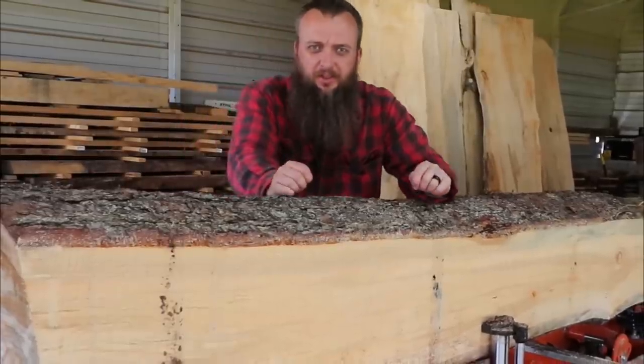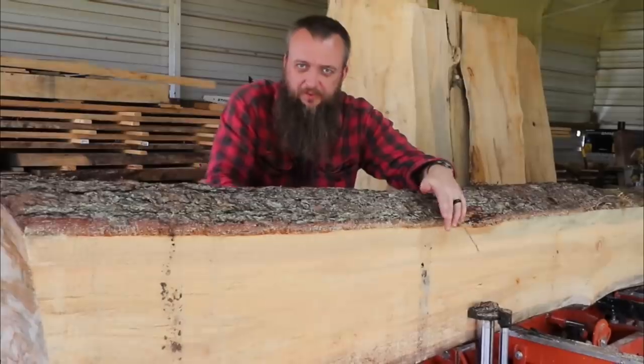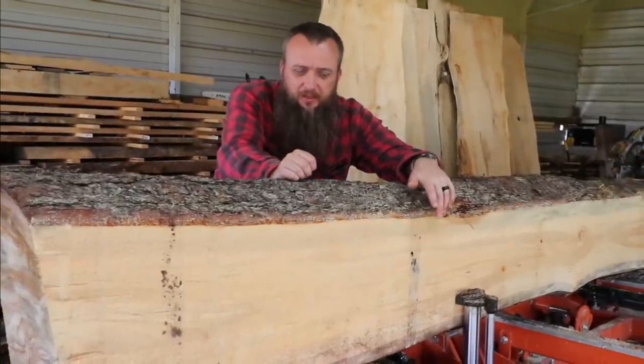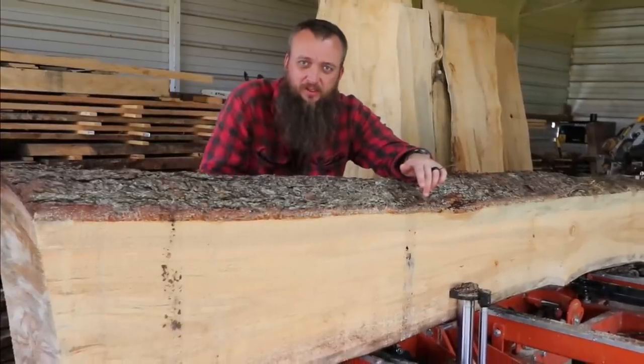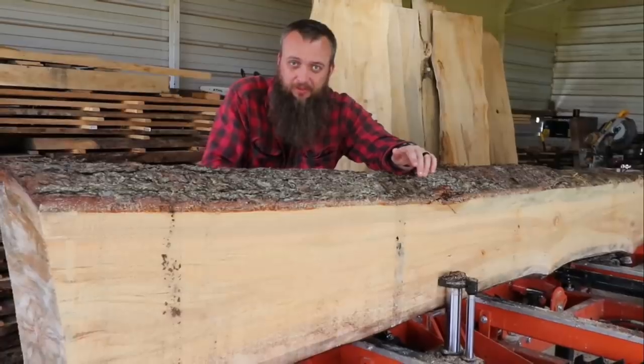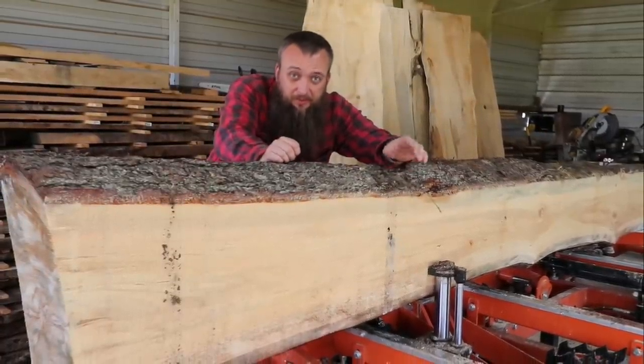Right now, friends, usually when I square up a timber, this is my third cut. I make two reference faces, one cut, turn it 180, make another cut, then I put it up on its side like this to make the very important third cut, which is going to either put the timber perfectly in square or it's not. And usually I'm done right here.